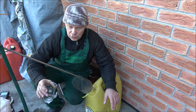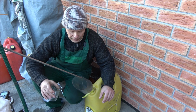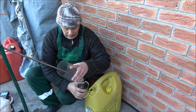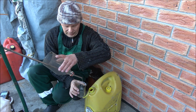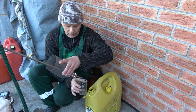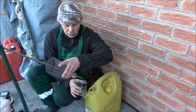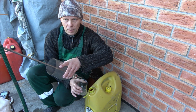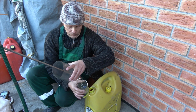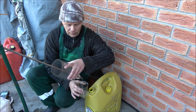And the best and most straightforward method to clean such a fuel is distillation. As you can see, it processes the fuel at the same rate as the centrifuge would, but it gives an absolutely transparent result. Absolutely transparent. Yes, the centrifuge and chemical method actually helped me to remove a lot of contamination, but here you can see that we've got absolutely clear diesel fuel.